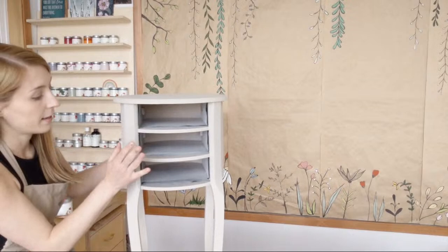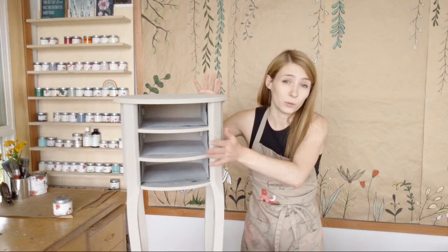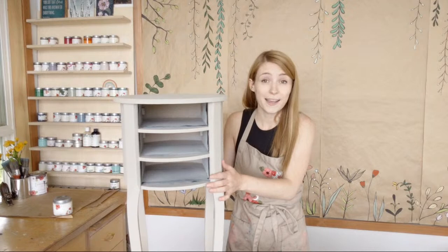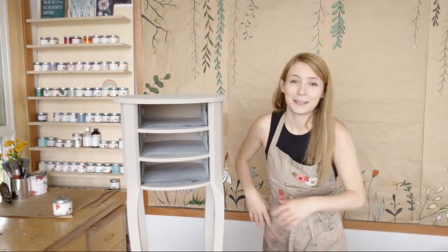This has had about overnight to dry — it's nice and dry, you can't scratch it off, no adhesion issues. I really want this layer to be on really well because when we go to apply the wet coating and only let it sit for about 20 minutes, when you wipe it off to reveal that nice white color underneath, you want that white to stay and not reveal the wood. These are kind of cheap faux wood, some sort of melamine — looks a lot better painted. It had a really sickly yellow color with hodgepodge distressing — some kind of Home Sense purchase from 2007, so we're going to dress them up.